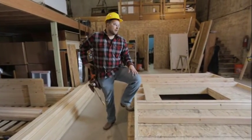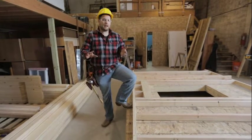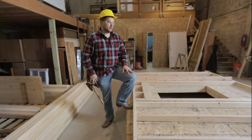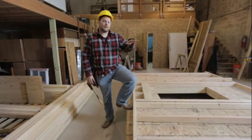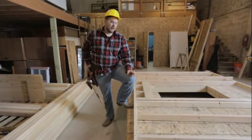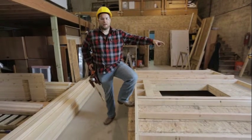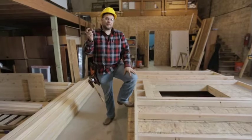And what that's gonna allow you to do is when you put your drywall on, drywall comes in sheets of 4x8 and they go horizontally along the studs. So if you do 4 foot and 4 foot, that's gonna be 8 foot. And they give you about 1 inch of playroom. So you can hide that at the bottom of your floor. You also have drywall at the top of the ceiling, that's 5/8.